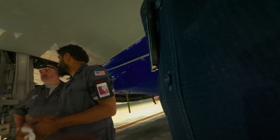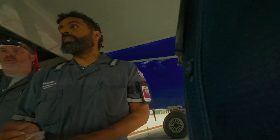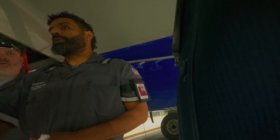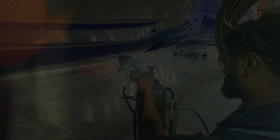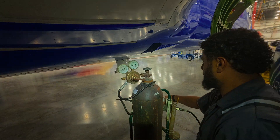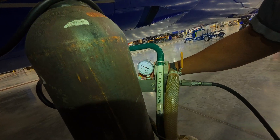You can hear it pretty good too — it's a definite change. It's better than changing all the nozzles. And better than the borescope approach where they bring them over, take the borescope plugs, and supply pressure on borescope each nozzle. I've got 45 psi. Okay, this one is leaking.